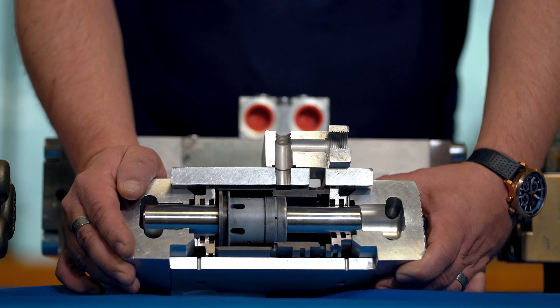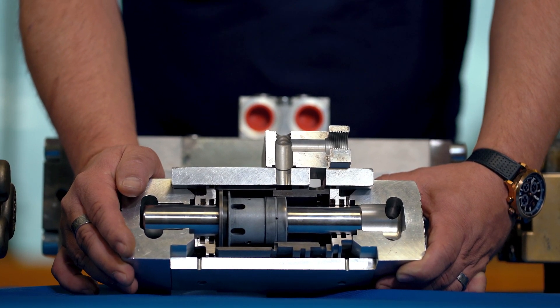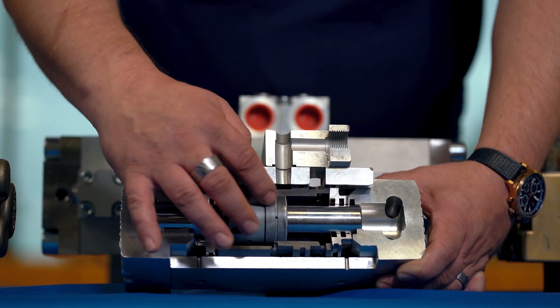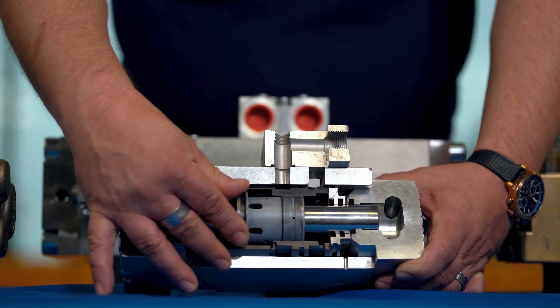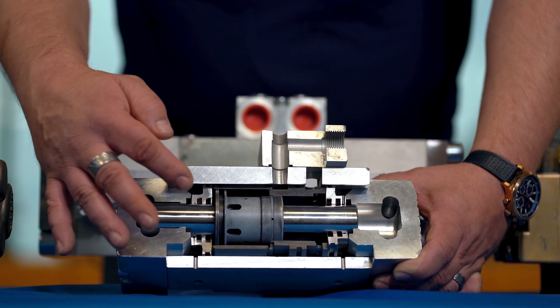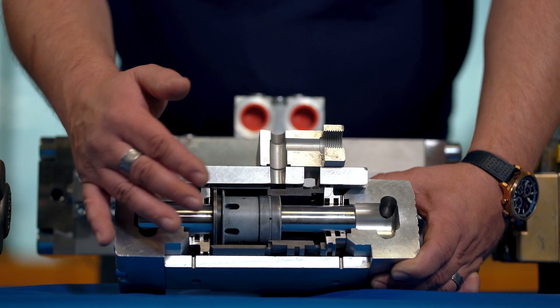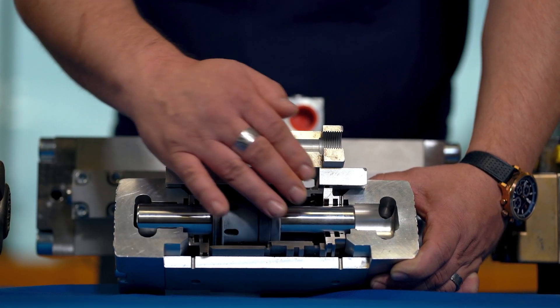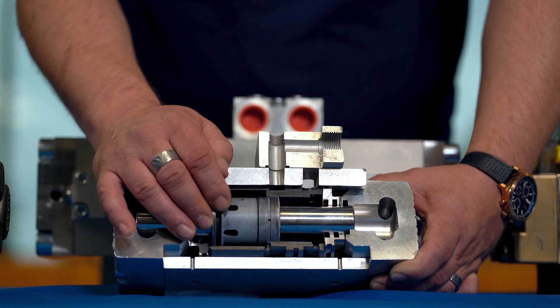But there is also a different way to do that. This pump is made with patented Dynaset technology. Here in the middle we have a hydraulic piston that moves inside the pump back and forth. Directly connected to the hydraulic piston are secondary pistons which actually pump the water. This system replaces all the gears and crankshafts that are normally found in a triplex pump.